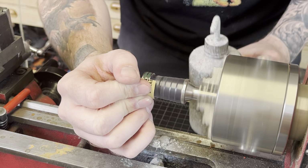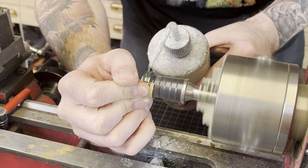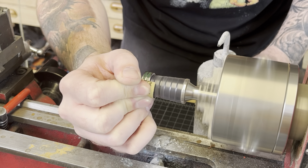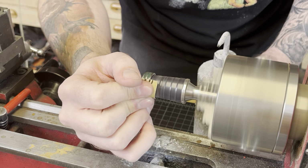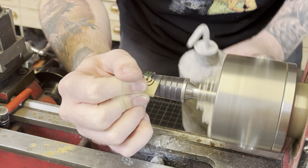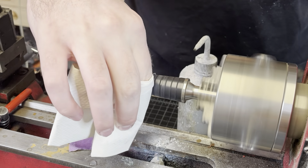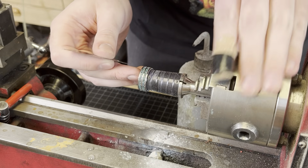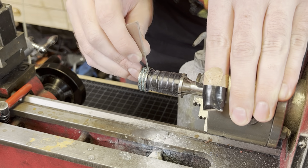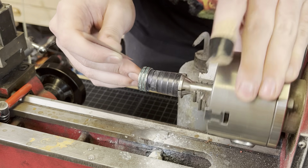Once it is sanded down flush, I'm going to do just a quick wet sand with our 220 grit, and I'm going to be inspecting both of those channels for any harsh lines that may have been left by that 80 grit drum, or any holes that may have appeared that we didn't fully get closed up with that super thin. And once I've inspected it and fixed everything that I needed to, I'm just going to do another couple layers of super thin to seal everything back up.